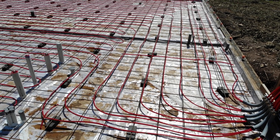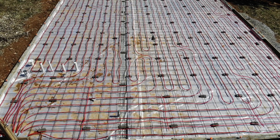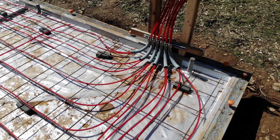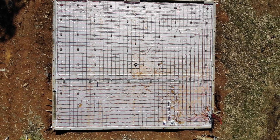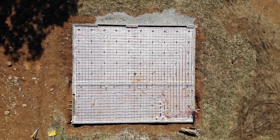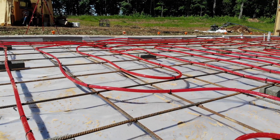LoopCAD told me I need about 1,600 feet of tubing for this project, so I bought two 1,000-foot rolls. This turned out to be a good decision because you can only really get three 250-plus-foot runs out of each roll. If you tried to get four, you'd definitely fall short on the last one and wouldn't make it back to the manifold. As a rule of thumb, if you're using half-inch PEX, 300 feet is the maximum circuit length.